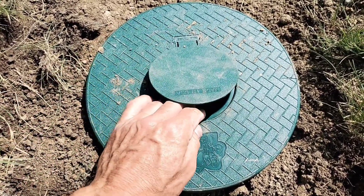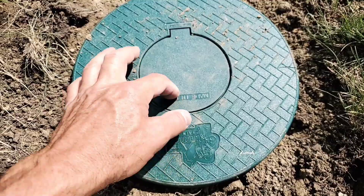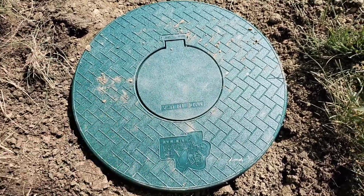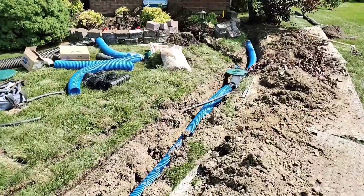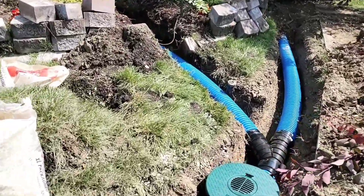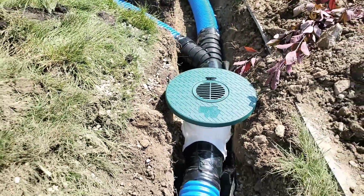Water doesn't cause any erosion. The water comes out around this turf restrictor plate, out the hinge. We put a lot of thought into this and we're really happy with the outcome. You can reach down in here and any tree seeds that may have floated and got caught in the elbow can easily be grabbed and pulled out. It's the first pop-up ever that is serviceable and indestructible. We have a riser on the inline catch basin to get it to grade — a two inch riser. It's perfect.